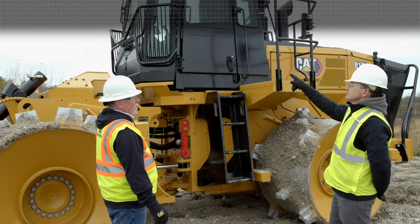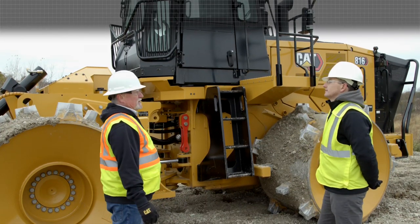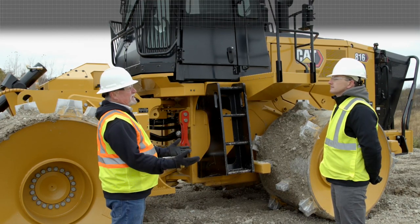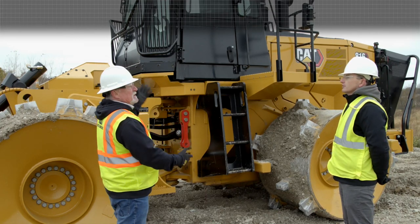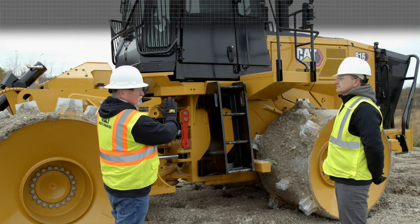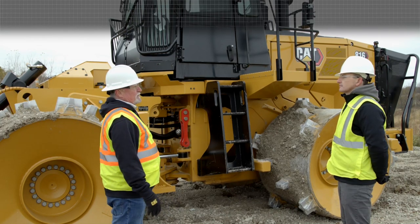Speaking of the window, let's talk about the rubber mounted glass. All of our windows are now rubber mounted — we've gone away from the previous versions of bonded glass. Because window breakage is prevalent in the landfill industry from material climbing up and breaking it, this is low-tolerance cut glass that zips in a rubber seal and pushes in and seals. We call it the zip-in, zip-out cab windows.